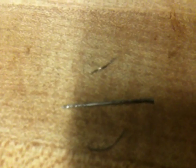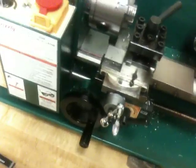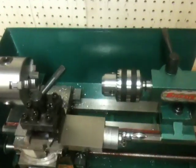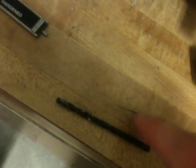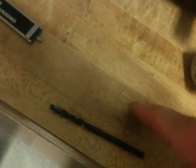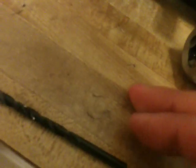So if I wanted to drill a 0.5 millimeter hole in a heater barrel on my lathe, the idea would be you'd want something like this — a chuck that fits into the tailstock — and you could hold a steady drill bit and then move that into the spinning piece, right? Problem is, that is way too big to hold that. Way, way, way too big. It just stuck to my hand because my hand has oil on it. That's how small that drill bit is.